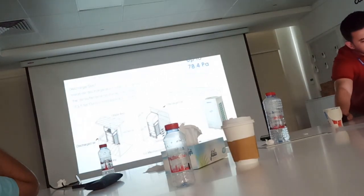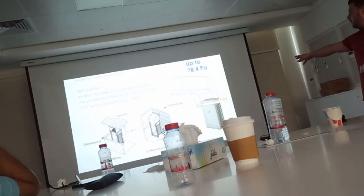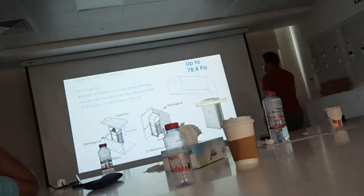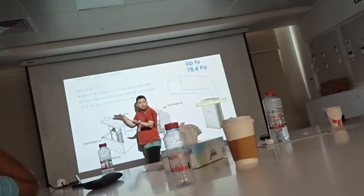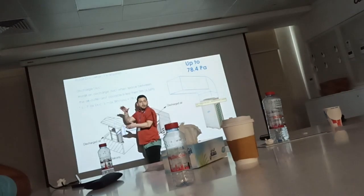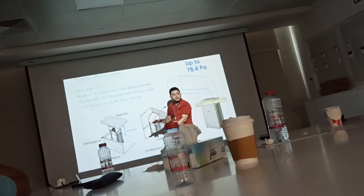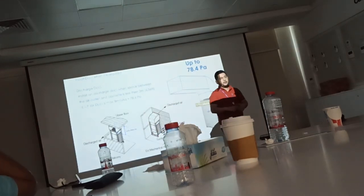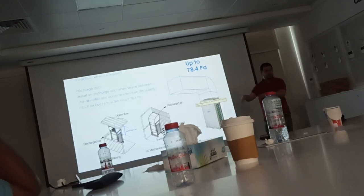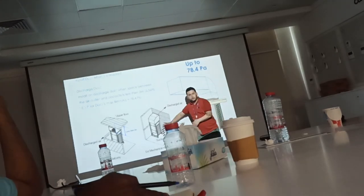This is if you need to fix the outdoor unit in a balcony or a mechanical room. If there is any slab above the unit, or any blockage, cover, or border above the outdoor unit, the clearance should not be less than 2 meters. If it is less than 2 meters, then you need to fix a duct to the open area to divert the discharge air. Okay? In a mechanical room also, you have a louver.